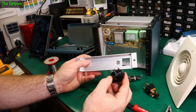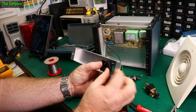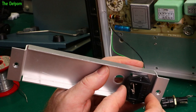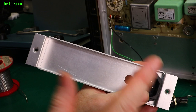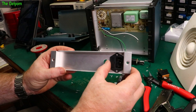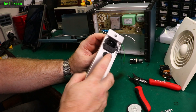This leaves me two holes. If I went horizontal I'd end up with a gap and would overlap the big hole — that's not going to work. So I'm thinking about putting it vertically, where I only have to cut a small piece each side to make it fit. I'll cut those out to suit, then put a grommet in to plug up the old fuse holder hole. Worst case, a small stubby bolt to cover it. I've nibbled that out — it now drops through. I've also fitted a grommet from my assortment which fits nicely.